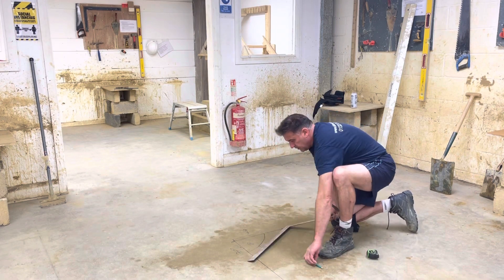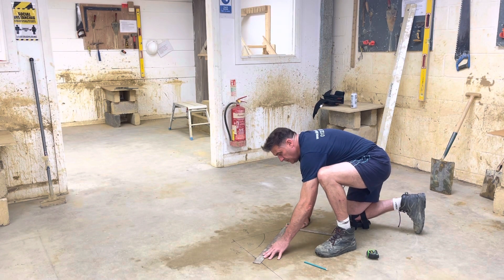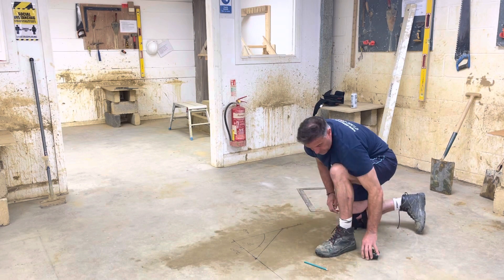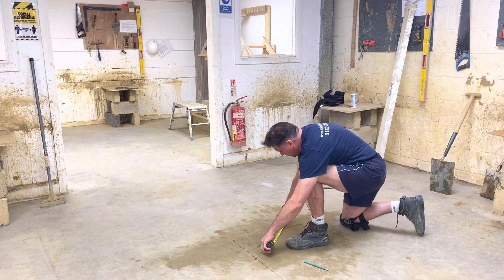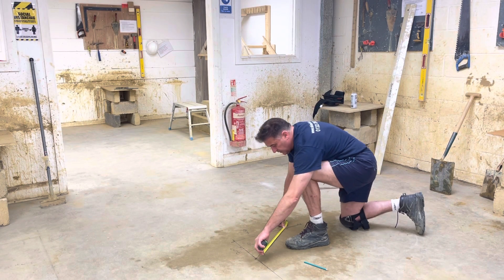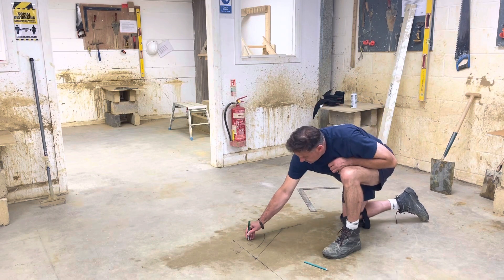You can draw the diagonal in like so. Measure along that axis from the 100mm point to make sure that if you have a nice 90-degree corner, it should be 600mm. And as I'm practising perfectly in every way — there you go. So now I know that I've got a 90-degree corner.